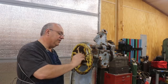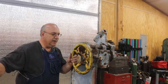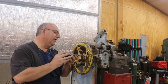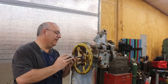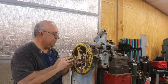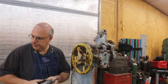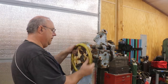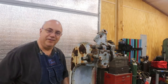Evidently, I got a little burr on the outside of this shaft — a little mushroom or something. I can't get in there with a file, so I got a Dremel tool here with a little sanding disc on it. We're going to go around this thing and see if we can clean it up. And there we go — that's all it took.